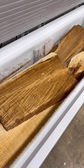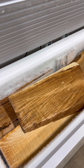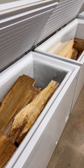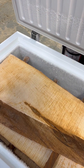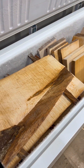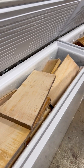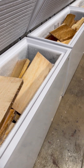This is where it's really challenging for companies like Kimball Hardwoods — they get cut in two-foot sections primarily. You get a five or six inch end check on that wood. It's just not what your application is supposed to be for guitar parts. This wood literally grows in a rainforest, and it is by far the highest percentage of moisture when fresh cut. The only maple I have ever probed — I had some quilt that probed at 70% moisture. That is insanely high.